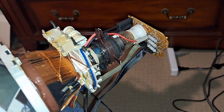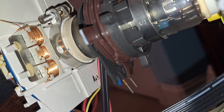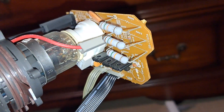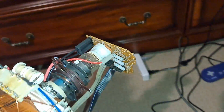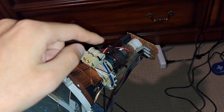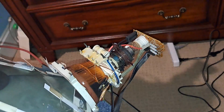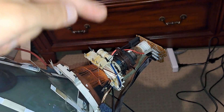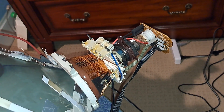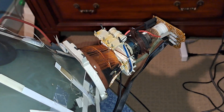Now there was some confusion between this set and a couple of other sets — especially the 14-inch models — about having scan velocity modulation that you couldn't disable. That's something I've noticed on this set particularly: it doesn't have any of those features, nor did the service manual show it either. So this is where it would have sat, but it's no longer there because they never put it in — and I doubt the last person installed it, because there's no plug on this neck board whatsoever to even show that. So that just goes to show that this 20AF46 does not have scan velocity modulation. If you look up anything involving a Toshiba 20AF44 or 20AF45 and they're telling you to disable it, this one doesn't have it — so you don't need to worry. Same with the Toshiba 14AF42 and 43: both of those I looked at didn't have any sort of velocity modulation wiring hooked up.